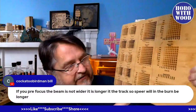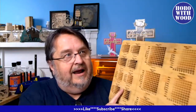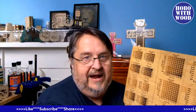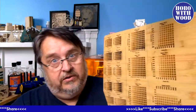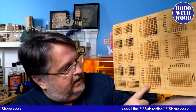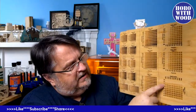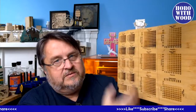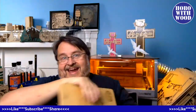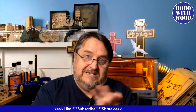These were both pre-focused the same amount. Whether or not I'm completely accurate in the way I perceive how that works, the results are the way I perceive it. Here, this is the same settings. Even on 20 watt, there's evidence of a burn, at 20 watts and 30 watts. There was nothing in 10 watt at all. But here, there's hardly any evidence at all, even under 30 watt. The difference was being scanned on the X and being scanned on the Y. That was the only difference. This was Y and this was X, and the X did not produce. The only difference was the scanning.